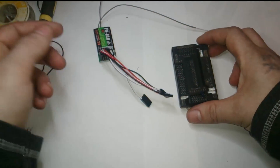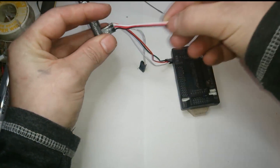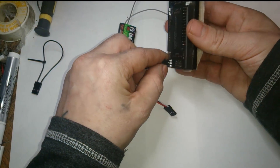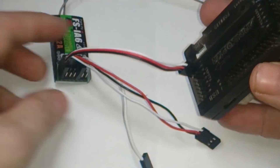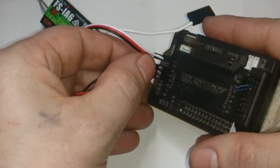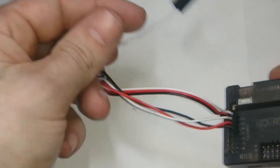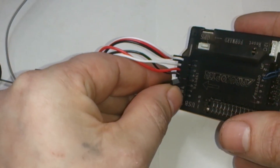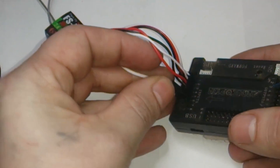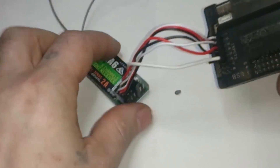Here's the APM 2.6 — it's really easy. It's basically inputs one, two, three, four, five, six. The first wire goes for number one on your inputs, the next for two, three, and four. Then you're left with one connector that goes for number five. You might think you still have one left because it's a six-channel remote, but I'll show you soon why you lose that sixth channel.